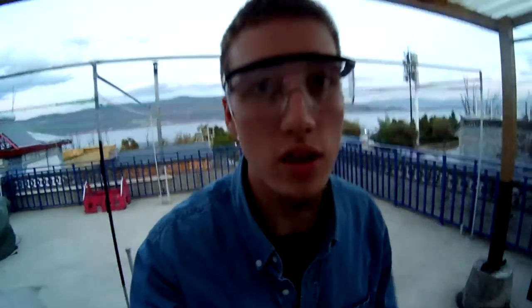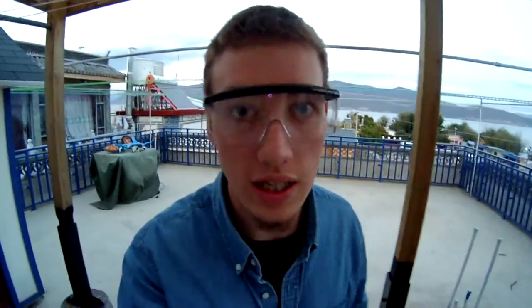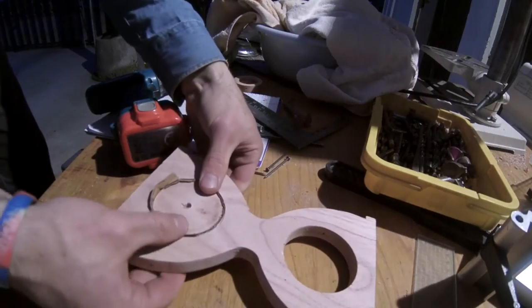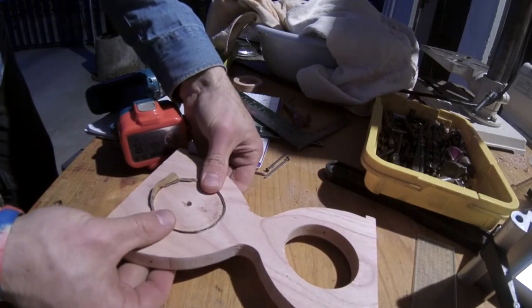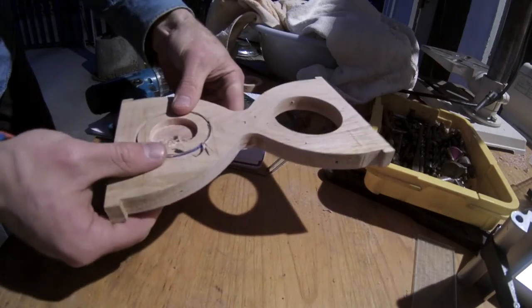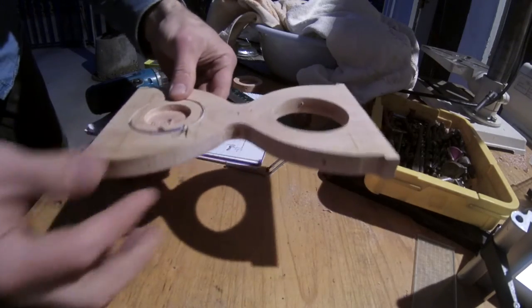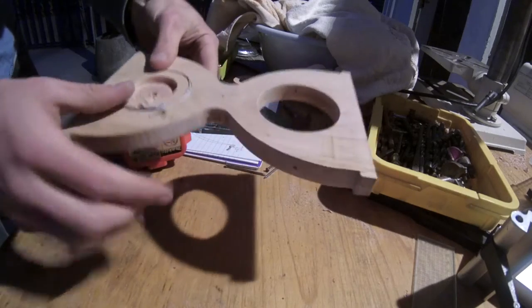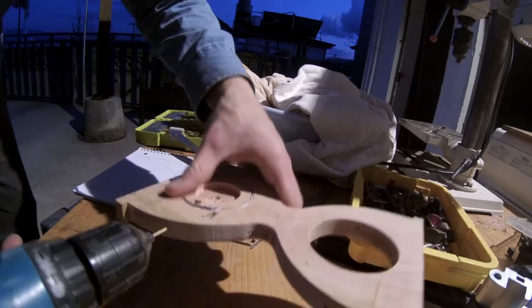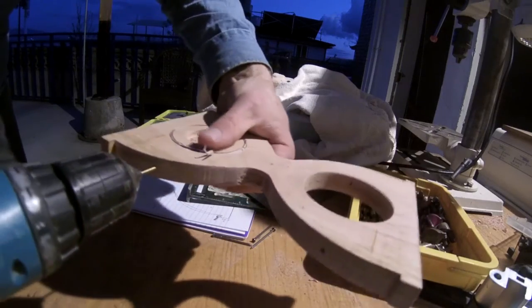Let's go ahead and drill the holes in the round pieces — this is one of the harder things to get accurate and correct. I found the best way is to put some cardboard around the round piece so it's even on all edges, then drill one hole and then the other without twisting it at all. It's important to make sure it's flush on top and bottom.